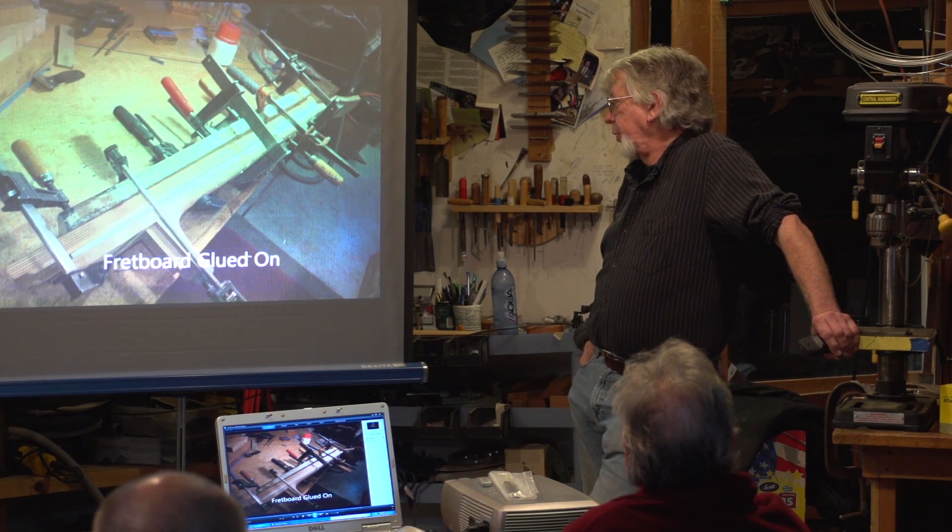Then we're filing the frets individually, holding them in a hand screw. I find it interesting that a lot of younger people have never even seen a hand screw. I love these things — I've had them since I was 20. We've filed and beveled the fret ends here. Each individual fret has to be shaped, rounded, polished through multiple levels of paper. I go up to 12,000 grit on frets, so they're like ice skating — they should be like 24 jewels on the ends of them. Fretwork is a signature for makers.